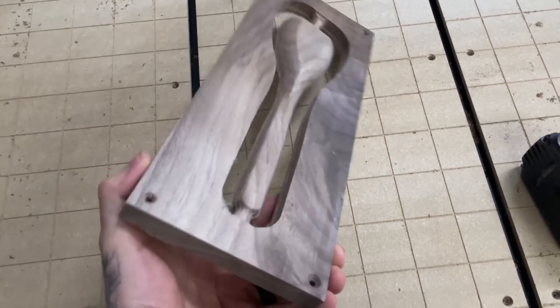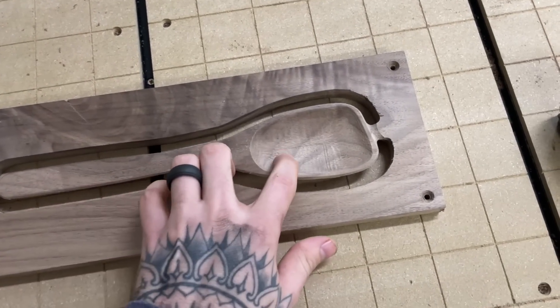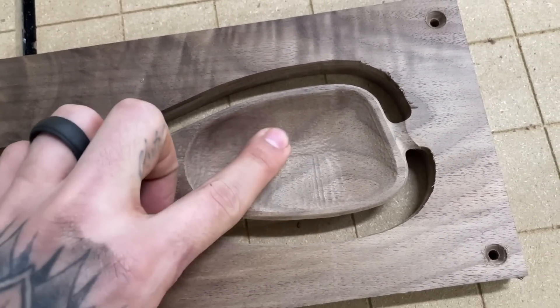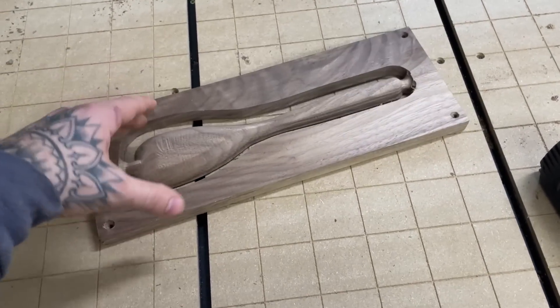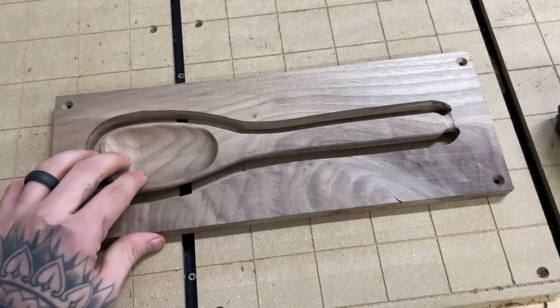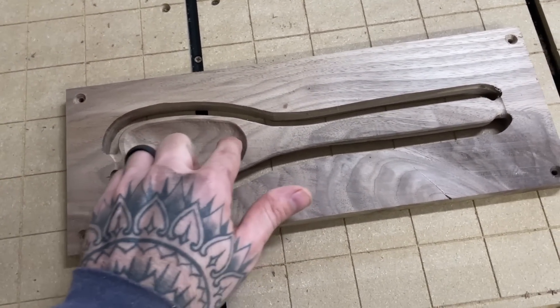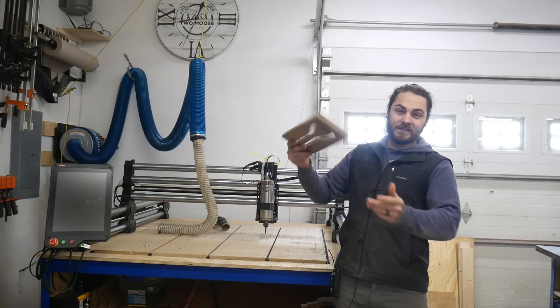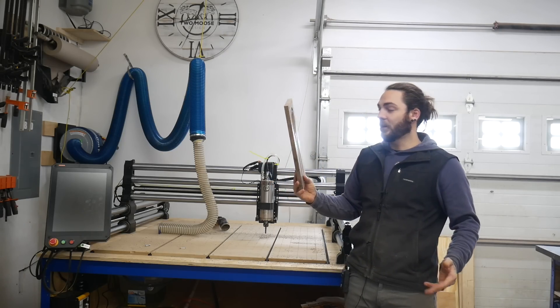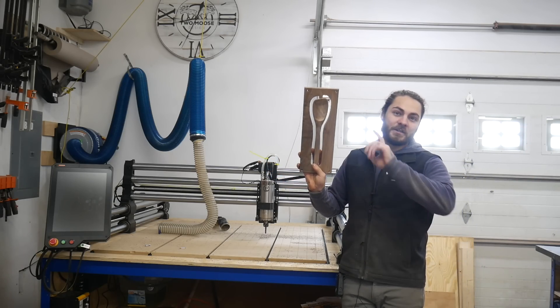Here's the Spoonchula file, available on our website. I carved this in just under 15 minutes. I'm going to have to dial it back a little bit on the finishing pass — we did get a little bit of chatter but I can sand that out. Just because you can go 400 inches per minute doesn't mean it's always the best solution. I would ramp it up a little more on the roughing — I don't care if there's a little chatter there — and then slow it down a little bit on the finishing to really clean that up. Super happy with how this turned out — cut it in 15 minutes, which is super impressive. The other machine takes about 22 minutes to carve this same file.